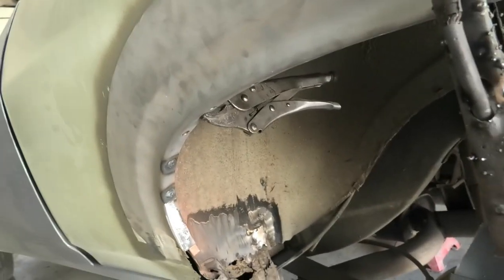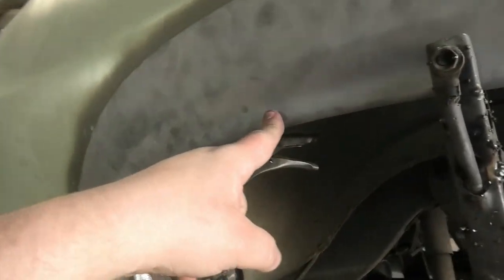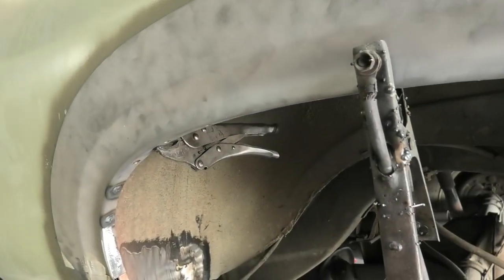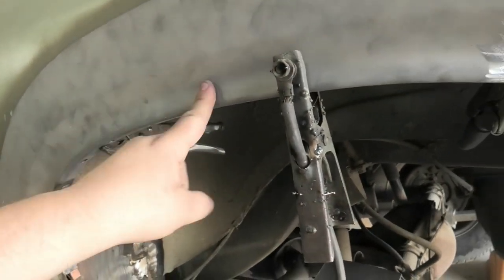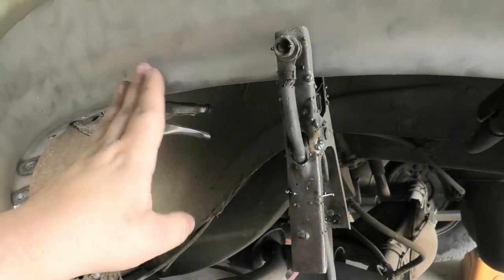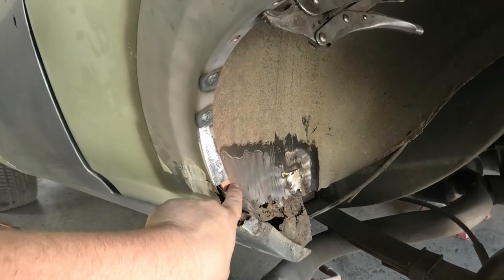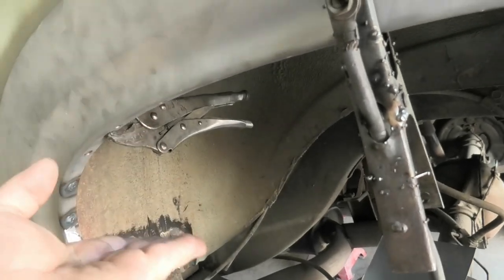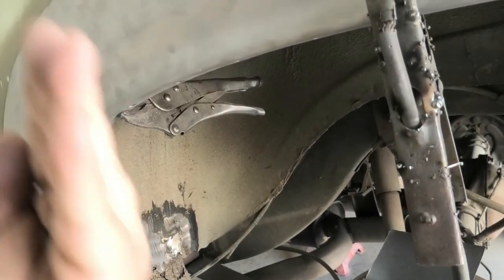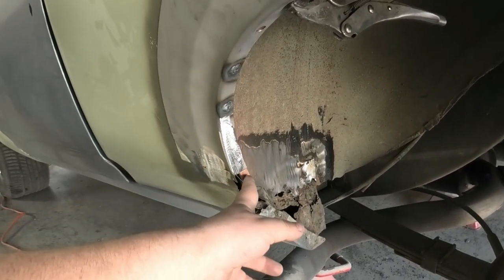And also, what I should have done is said before actually showing this, what I sometimes used to do for customers' cars when they said they were going to put some really big honking meats underneath the back of them, I'd roll the guards for them mid-repair. So to make a super, super tight repair, instead of doing this extra fold back, I would just have it come down as a straight, put the outer skin on, and then fold the skin super far up, because then you're not folding two layers, you're folding one layer over the top of effectively a sliver.